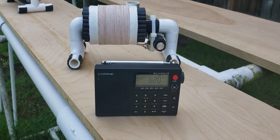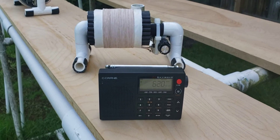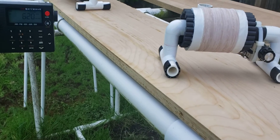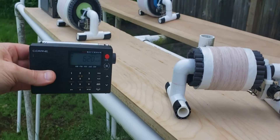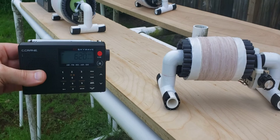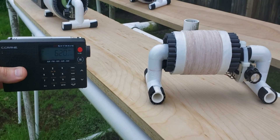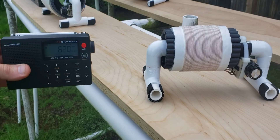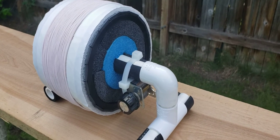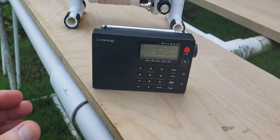I've done a low-band station. Let me explain something: only with ferrite rod models can you also get a peak off to the side of the FSL, and then again you have to play with the distance. You can see I have a pretty decent peak off to the side of this ferrite rod model, which is the 3-inch baby FSL. This only applies to the ferrite rod models — don't try this with a ferrite bar model like this 5-inch frequent flyer. That model is for DX expeditions and only boosts off to the front. So anyway, 620 has been boosted.